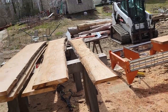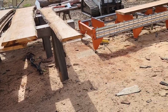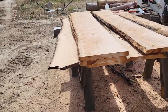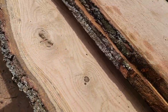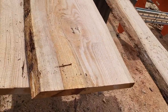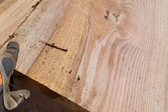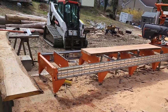And that band cut that whole black oak yesterday, and this, I'm not sure. I think it's just a red oak, to be honest with you. It's not a white oak. Now if you look at this slab right here, being out in the sun, it looks kind of white oaky, but it's not. I think it's just plain a big red oak. It's not a scarlet. It's not red enough, and I don't think it's a black because it doesn't have the yellow in the cambium layer. So just a red oak, but a really nice one.